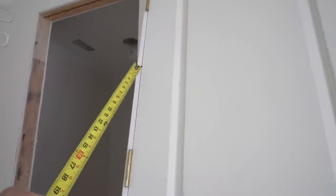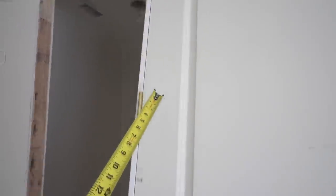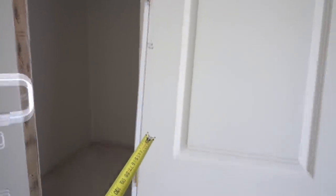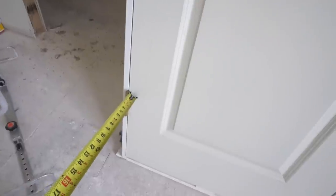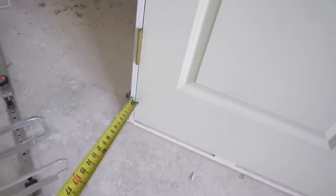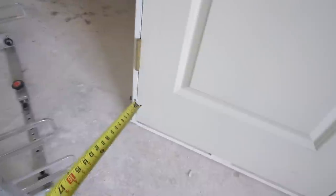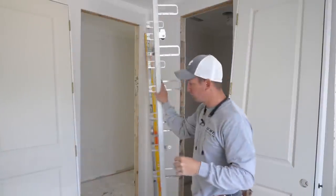Then we'll have a shim point in between all of the hinges. On the center two hinges, I like to go dead center — that works pretty well for me. At the bottom, we'll have a shim on the top side of the bottom hinge, and then as far down as I can go with the Jam Master — you can only go so far down and be able to route it out, so that bottom shim will be about down in here. I'll go ahead and prep these two openings with the Jam Master.